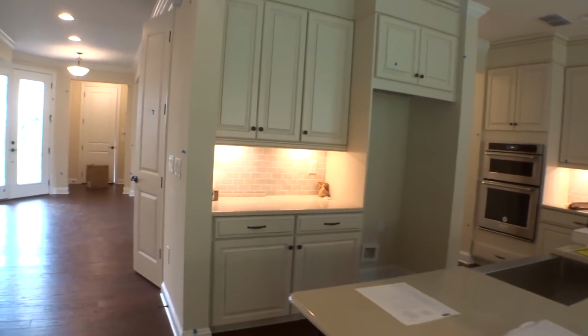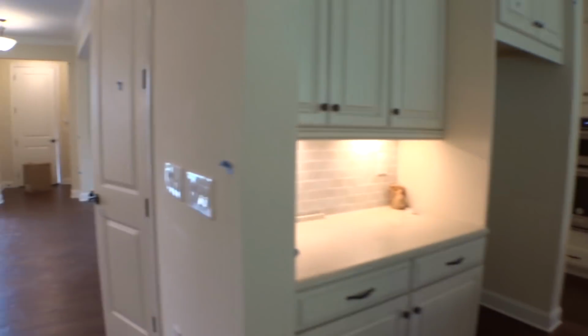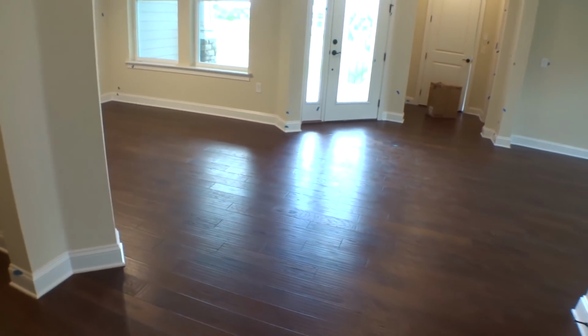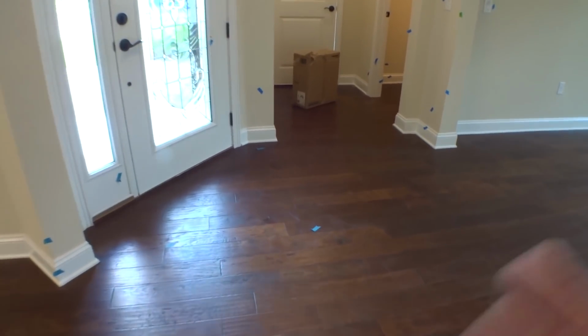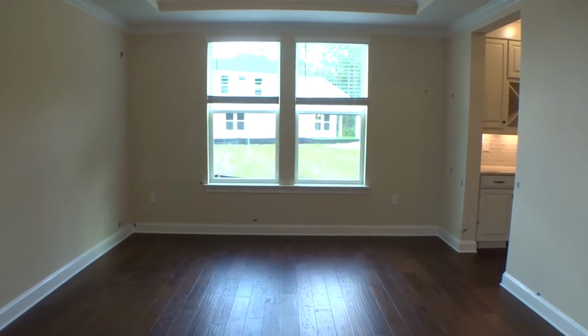I think we're in pretty good shape. I think we're going to be fine. He's going to go over the floor again. Not only are we going to paint the baseboards, he's going to have them go through and re-caulk all of the quarter round all the way around, to make clean and crisp corners. Then he's going to have the whole floor re-cleaned, whatever little paint splatters, things like that. They can clean all that stuff. Other than that, we're in pretty good shape.